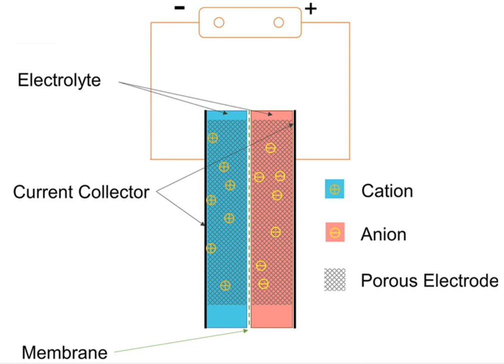At room temperature, leakage is so low that it is specified as time to self-discharge. Supercapacitor self-discharge time is specified in hours, days or weeks. As an example, a 5.5 volt Panasonic Gold Capacitor specifies a voltage drop at 20 degrees Celsius from 5.5 volts to 3 volts in 600 hours, 25 days or 3.6 weeks, for a double-cell capacitor.